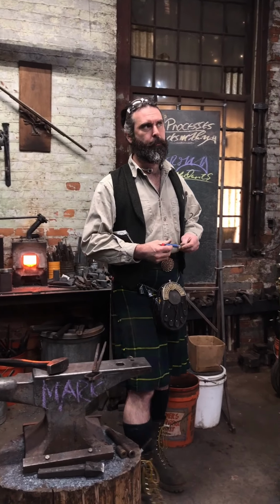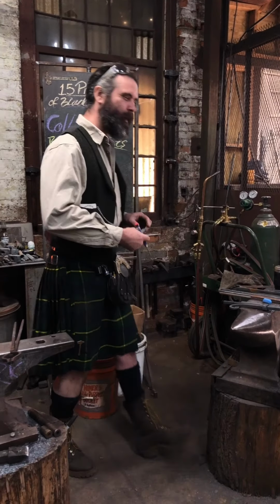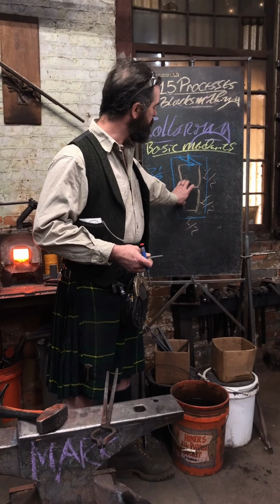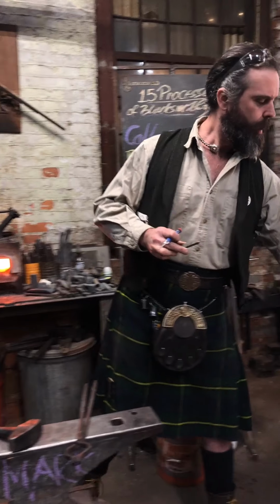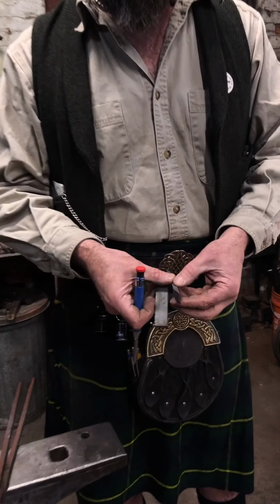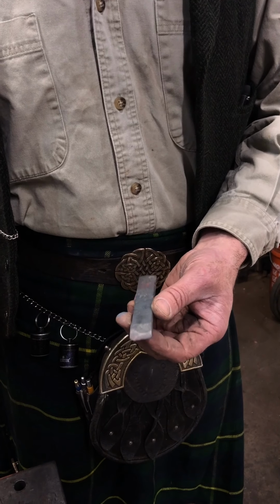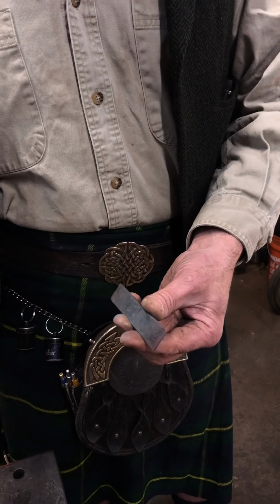So the basic mechanics, right? Yeah, mechanics of this. Again, we're still keeping with the 1/2 inch square construct, so 2 1/2 inches square, 3 1/2 inch starting material. What I've done is I've thrown a little bevel on either end. That's probably, I don't know, 5/8, 3/4 long, somewhere around about that.